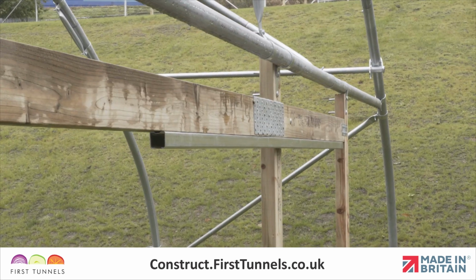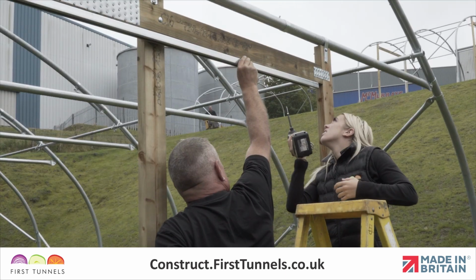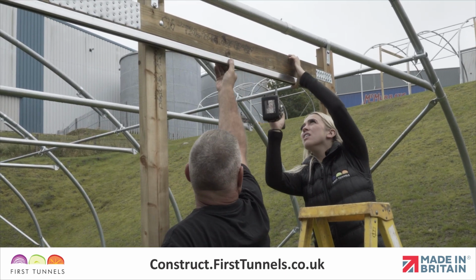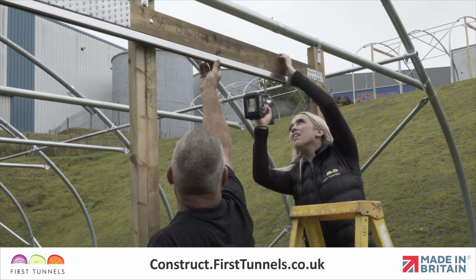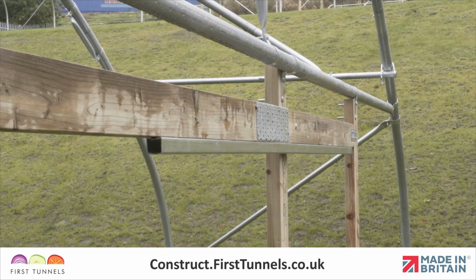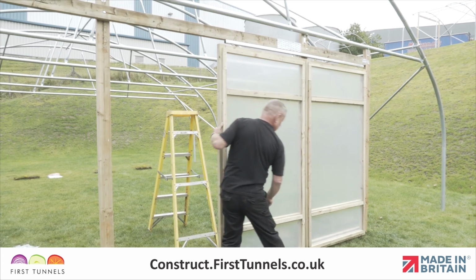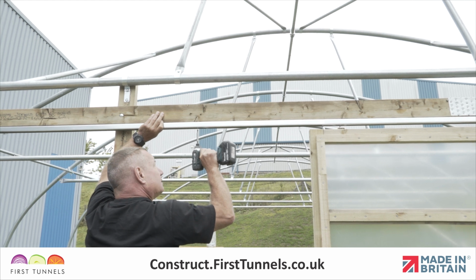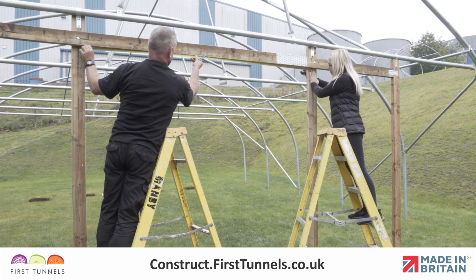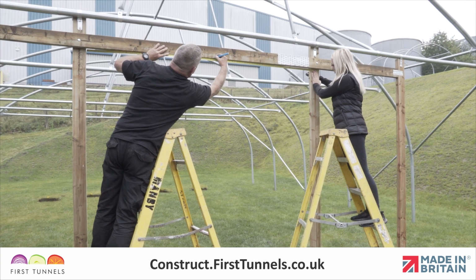We will now fit the sliding door track. The sliding door track is supplied in 2 pieces and is screwed to the underside of the door frame lintel. To make fitting the track and doors easier, we will fit one half of the track, slide both doors along with the door stops, and then fit the second half of the track where we can simply pull the door along. First, measure the width between the 2 inner doorposts and make a mark on the door frame lintel in the centre.